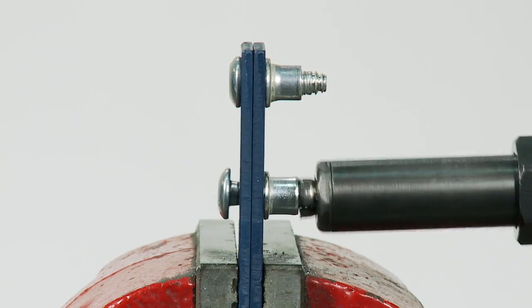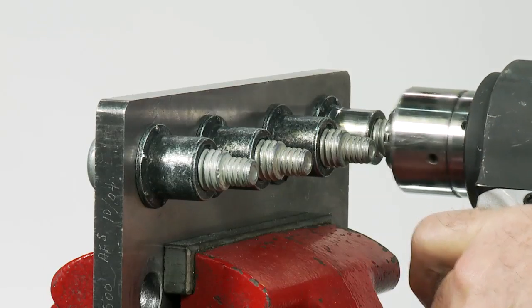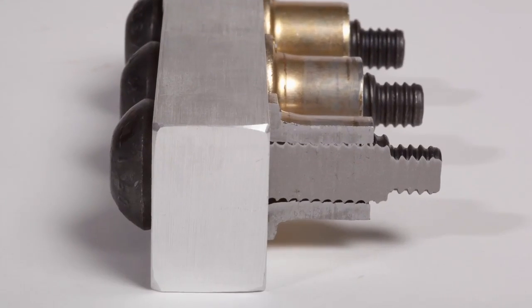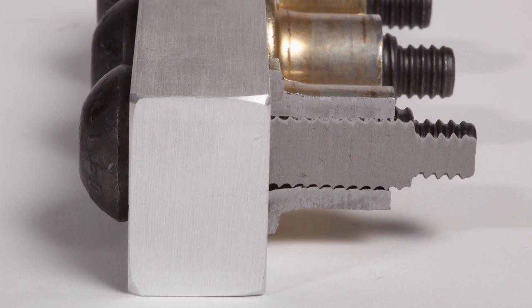What's really important with a fastener is the preload clamp. The clamping is more a function of the geometry of the collar and the metallurgy of the steel. What we do is we actually swage that collar, forcing that material into the lock grooves. When it's swaged, there's no relative motion — it becomes one part when it's installed. We have precise clamp and it's vibration resistant.